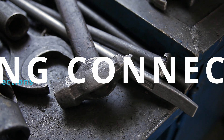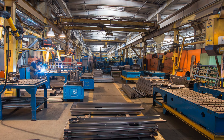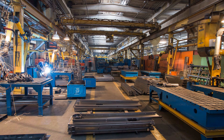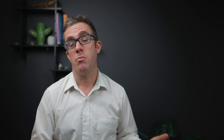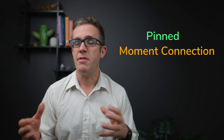One of the most common methods of connecting steel structures is bolting them together. This allows you to have fine control — putting holes in precise locations in the factory and manufacturing the bolts in a factory setting gives you higher quality control. It's also quicker, as you can pull it up and just bolt it together. Bolted connections can achieve either a pinned or a moment connection, giving you that versatility.